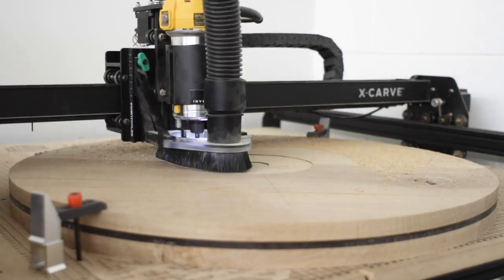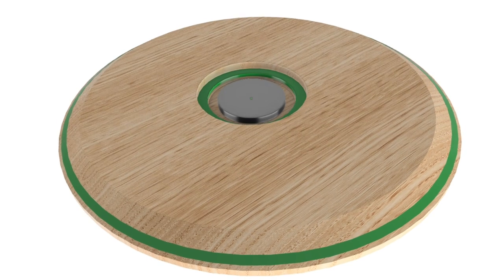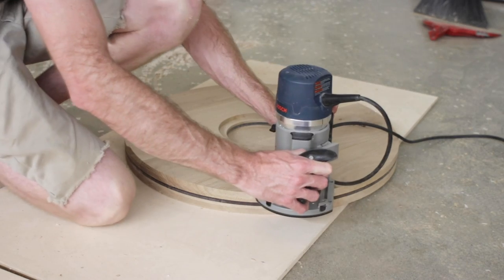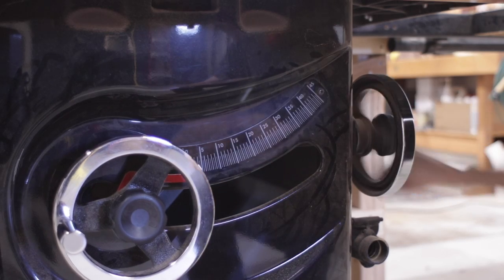From there, I used Chris's X-Carve to cut a stepped recess to house some LED lights. That's right, this one not only has epoxy, but it has LED lights too. Pretty sure aliens love LEDs. Finally, I cut a bevel on the underside of the tabletop, which I started with a router and a chamfer bit. But I eventually decided I wanted that bevel to be a little bit steeper, so I took it to the table saw. I didn't film this part at Chris's shop with my actual tabletop, so here's some footage of me doing the exact same technique on a smaller piece of scrap wood.